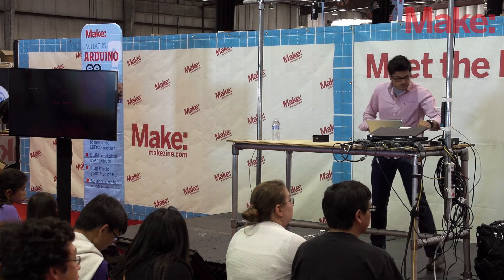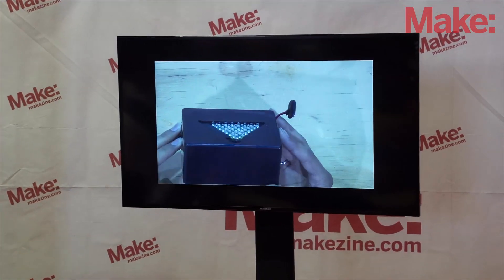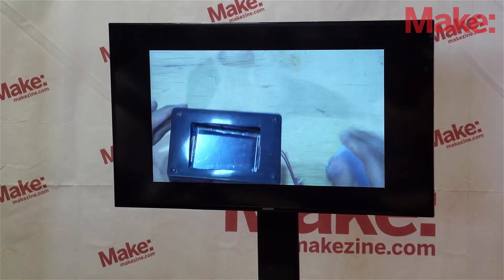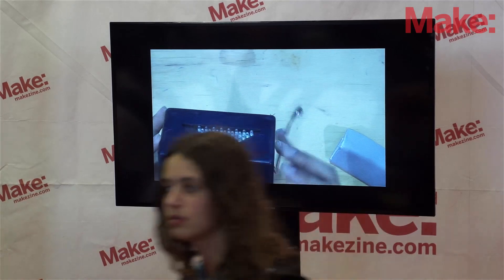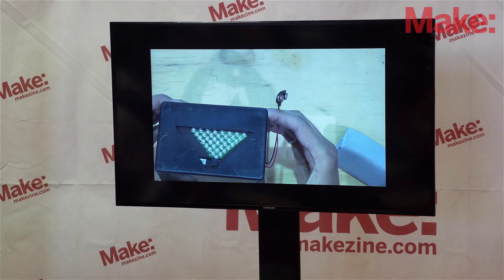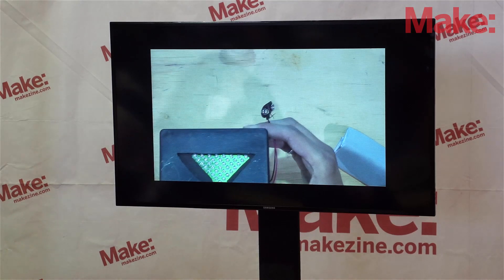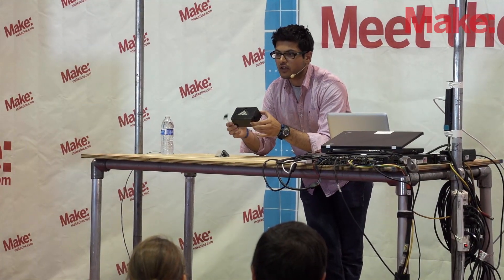So what is our solution? This tiny little point-and-shoot camera is basically our solution to this problem. We have a simple touchscreen in the back with a Raspberry Pi hooked up to it, and in the front we have a triangle array of infrared LEDs. We shine light into a person's eye, and depending on what kind of refractive error they have — whether they're nearsighted or farsighted and how much — that's what we output back onto the screen. This is essentially a $50 portable vision screener.